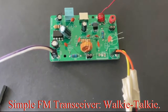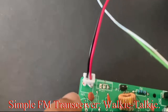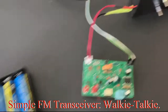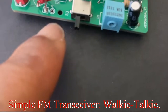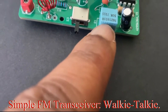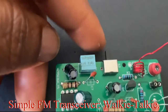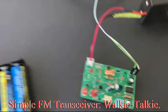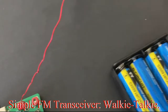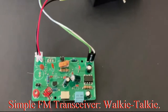We are going ahead to put the jumpers on both circuits. We remove the 5V regulators. This one is functioning now as the receiver — switch away from the variable resistor — and this one, switch towards the variable resistor, so this is the transmitter and that is the receiver. Let's test this out. You have seen the circuit is working properly.